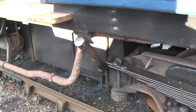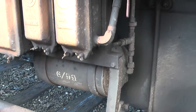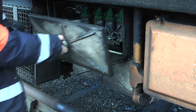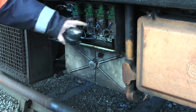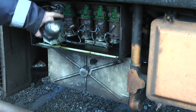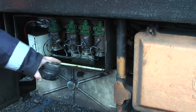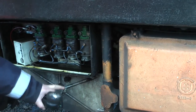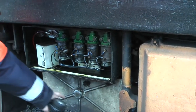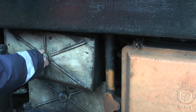That's your diesel tank. There's one for each engine. That's an air tank, just a drain tank. Well, it's on about EP valves, the electrical valves that open up and let the compressed air through to the control. They get fed electrically and open up and let the compressed air through for each gear of the gearbox. The ones in here are for the throttles and the change of direction. So there's six in there and four in there. They're all the same, they give very little trouble.